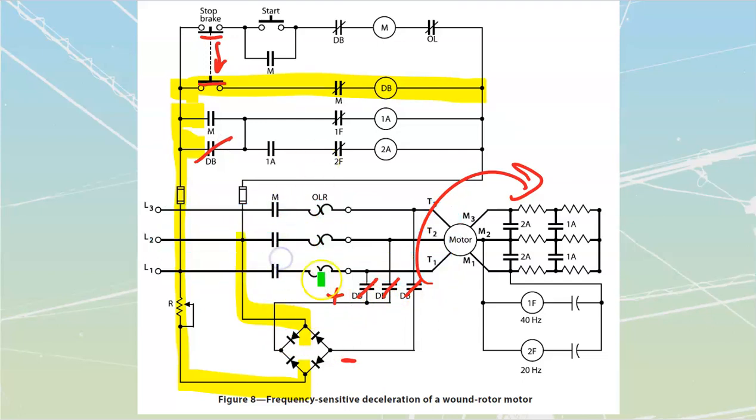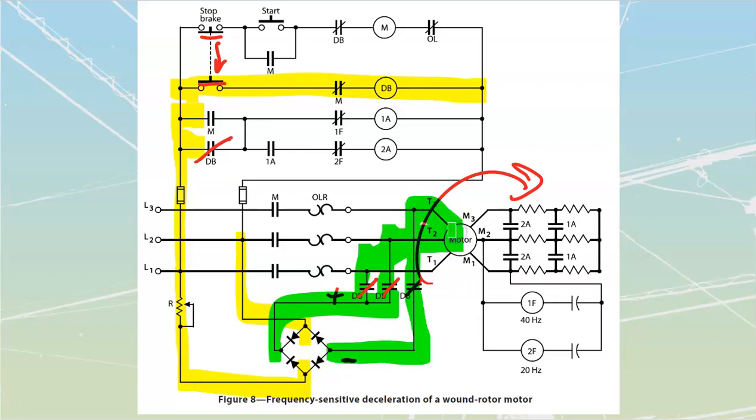As soon as we close these in, we're going to be applying DC. So my M all dropped out. We'll start applying my DC to my motor. So now I've got a set fixed field that my motor is actually spinning inside, right? We still have that inertia going. Because it is spinning inside, now we've got maximum distance. We've got a stationary field over here, and we've got a rotor that is moving somewhere near that 1800 RPM. Therefore, as a result, we're going to be back to seeing maximum values of frequency off of here. So right now we're going to see maximum values of frequency, which means that these are going to be sitting popped open